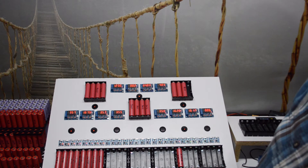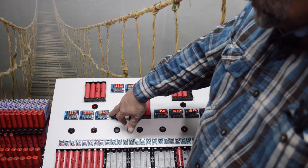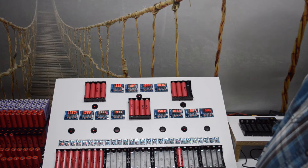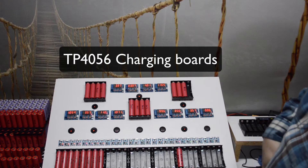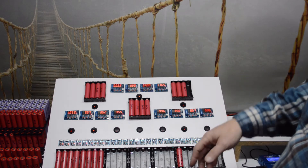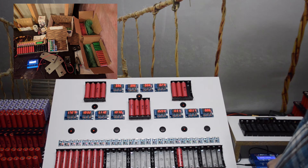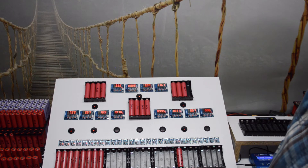It'll take roughly a couple of hours for them to do their thing. Some are getting pretty close - one's at 17, showing maybe 18 - so the bottom rail is getting closer. There are different ways to do charging; you don't have to use these chipsets. DIY Powerwall, for example, bought pre-made chargers that run off USB ports and work great for both charging and discharging. I used to use my IMAX B6 mini for discharge; now I only use it for checking cell resistance.